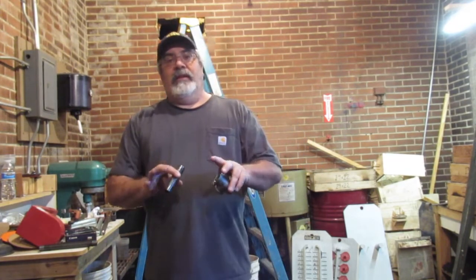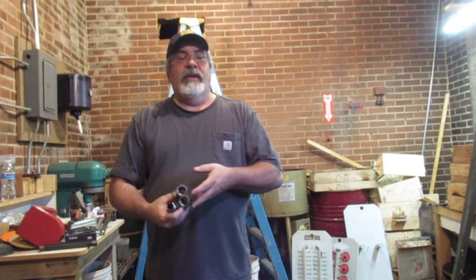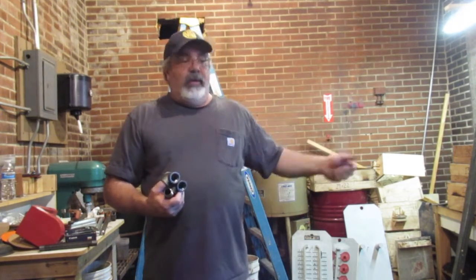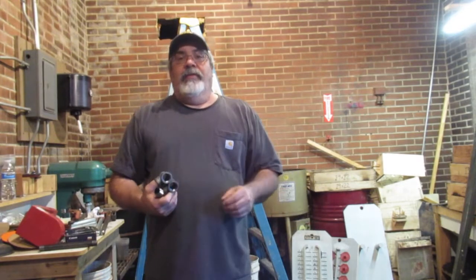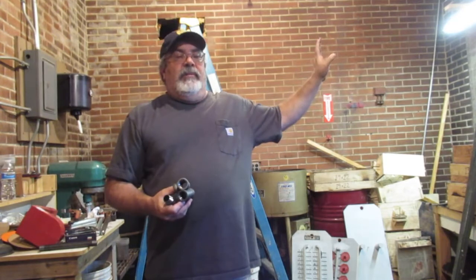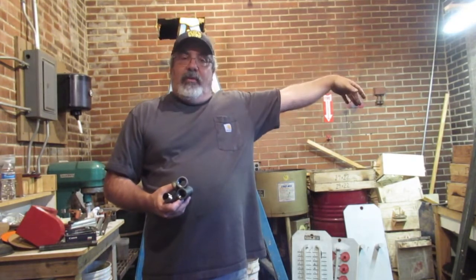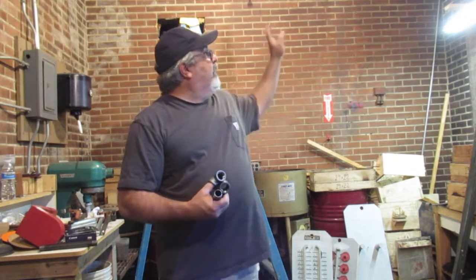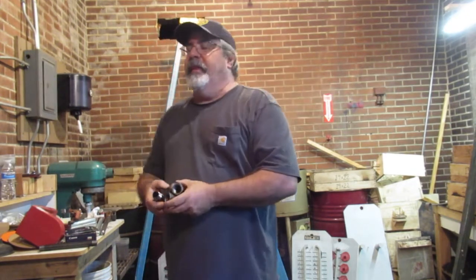So there's at least 2 right there. Plus, I'm gonna want a regular quick snap fitting over there. It will have an air hose to blow the molds out. At the very least, we're gonna have 3 outlets over there to run the machine. So I'm just going to put the 3/4 all the way over there, and that way it'll be a bigger line instead of just putting 1/2-inch to feed 3 things, okay?